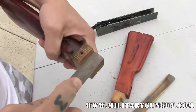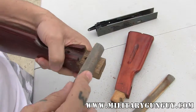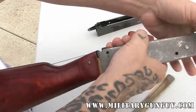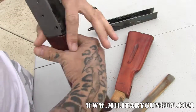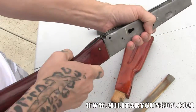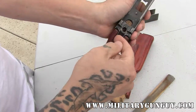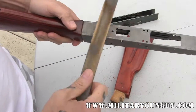You don't really need to worry about certain areas — typically those areas don't need any sort of fitting. You also may need to chamfer this edge a little bit as well, so just hold your rasp at a 45-degree angle and cut that area down a little bit. Then test fit. This does tend to get a little bit tedious. Okay, it's getting better — fitting a little bit better. We'll still have a couple of areas we need to see. I don't like this gap here, though. If you close this too much, you may have to Dremel this little part here to make it a little bit more uniform. I like these things to be as close to perfect as possible.